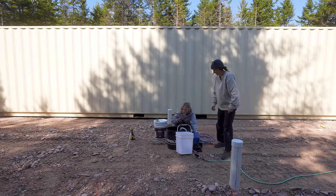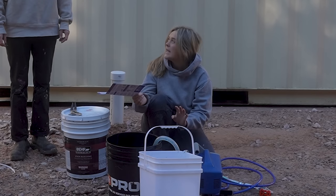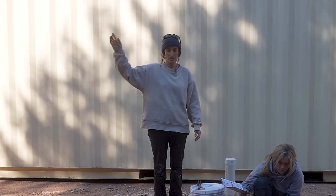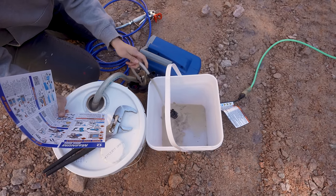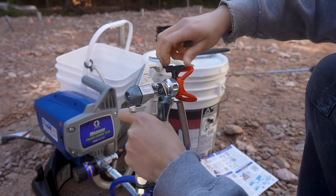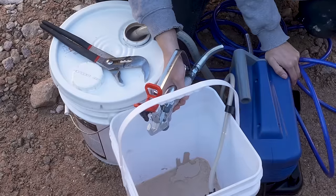Let's see how loud it is. I'm very interested. Not bad. 30 seconds. 28, 29, 30. Now submerge suction tube into paint, right. Turn the power switch on and watch for paint to come out the drain tube. Turn power switch off. Rotate spray tip to unclog position. Unlock trigger lock. Oh, do you have to spray the right way, Chris?